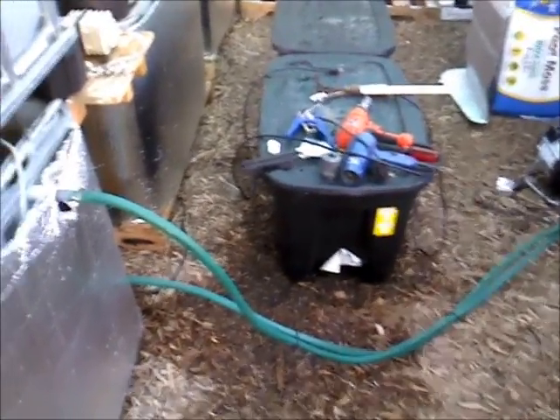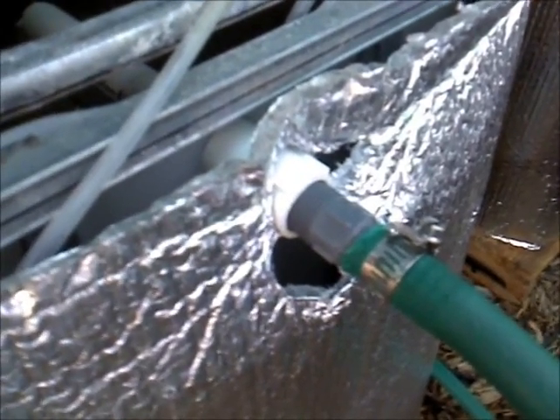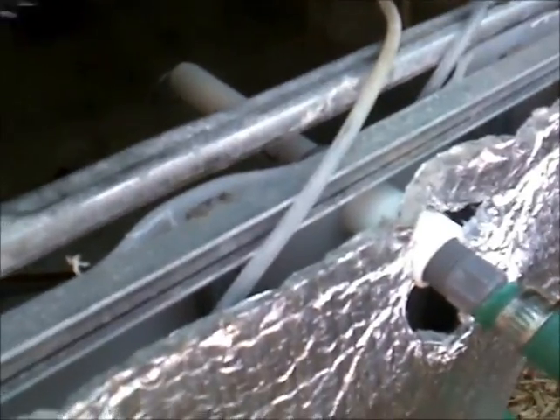I'll probably come back and put some insulation. I've got that going into the tank — it's got water flowing into it. I just drilled a 3/4-inch hole, used some 1/2-inch nipples and female and male adapters and put a piece of pipe in it. I've got that run into an Aquatop 496 gallon per hour pump that's opened all the way. I had to purge the lines of air to get it to run, but you can see the water flowing out. It's not a big stream, so it should be just about right to heat the tank up.